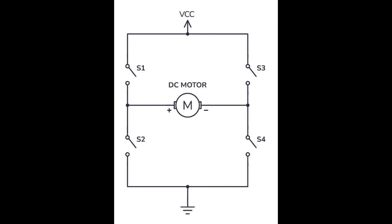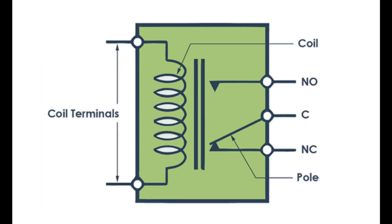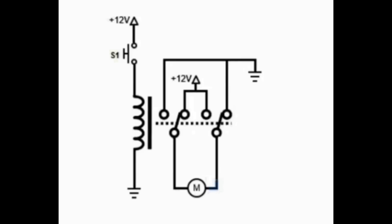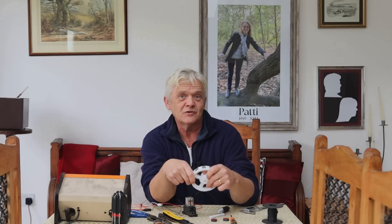There is a way of doing that automatically — it's called the H-bridge. The H-bridge is really just a couple of switches that swap the positive and negative wires over to create that effect. We can make those switches out of a whole host of things. I quite like using this — it's just a relay. A relay is a couple of switches controlled by a coil; when the coil activates, a little lever moves between two points acting like a switch. We could equally use a transistor, which is just an electronic switch, but a relay makes it obvious that we're just switching. So we can make our H-bridge out of a relay by wiring up this circuit.